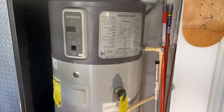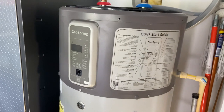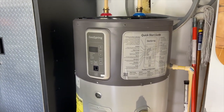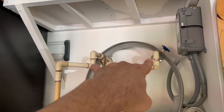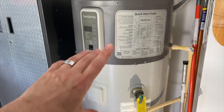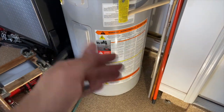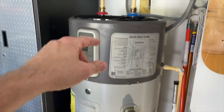Hello YouTube. What I'm doing today is changing the anode rod in my GE GeoSpring hybrid water heater. I've turned the power off to the water heater. The next thing I'm going to do is use my shut-off valves to shut the water supply off. I've connected a hose on the bottom and I'm draining a little bit of water — just enough so that it's not pressurized — but I want to leave a lot of the weight of the water in the heater so it holds it down while I'm getting the anode rod out.